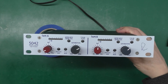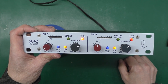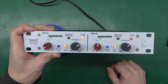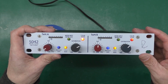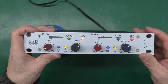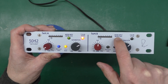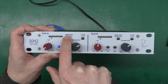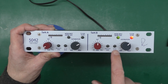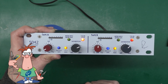One final power-up — there we go. I can't easily test it without hooking up a whole load of audio gear, so I'll hand it back to my colleague and let him verify it's all working. But I think that was the problem: the DC-to-DC converter was faulty, and a couple of caps were probably past their sell-by date as well. Another repair done — thanks for watching.